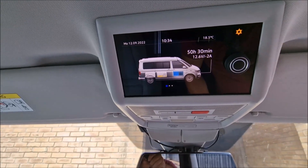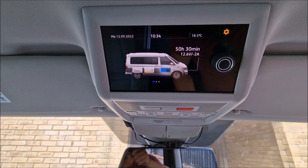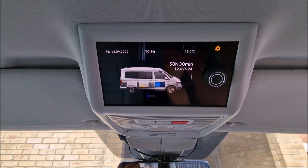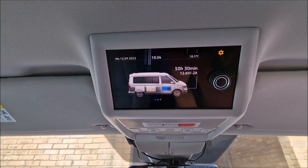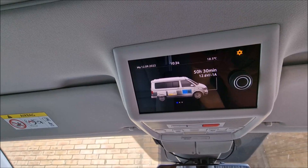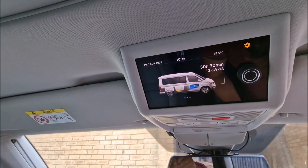When you are using it, it can help make sure you're not losing too much when charging phones or with the fridge on. If we turn the fridge on and go back, you can see we're losing about one amp, so we are depleting it slightly. But once the fridge gets up to temperature it draws less power.